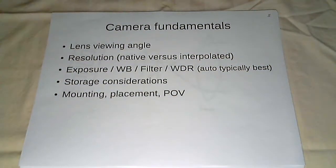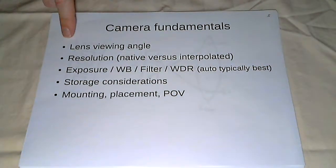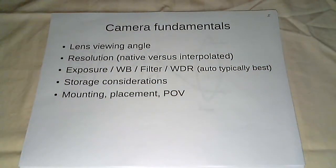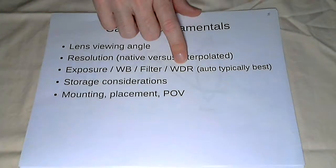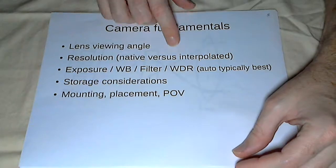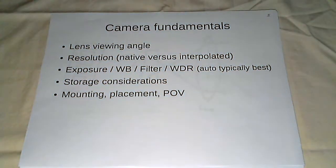The more money you spend, typically the better optics, the better CCD, the better features you're going to have, such as WDR. That's why I want to talk about this real quick. Along with having more resolution, we have a more sensitive CCD working with a video processor that can then kind of tease out more detail or better handle artifacts, strange lighting conditions, abrupt changes in lighting or motion artifacts, to use with features like WDR to give you a clearer picture. WDR primarily is a feature that's starting to become popular in some of the more 100+ cameras, and this means wide dynamic range. It just means that the CCD is more sensitive, can let in a little bit more light, and therefore the video processor has been tuned a little bit to take advantage of that and to help build a clear picture.